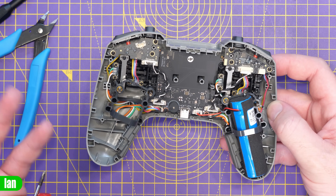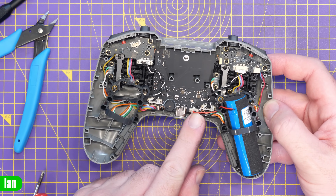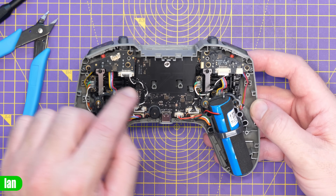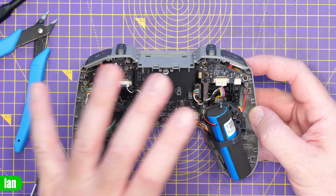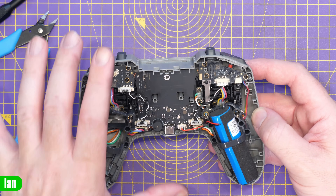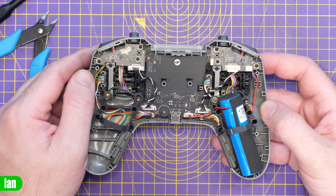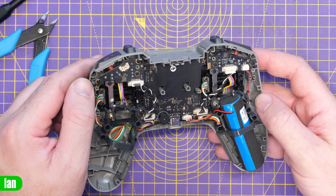So if you wanted to do a mod on this, there's potential for adding another battery in there, although there isn't a connector — you'd have to parallel them up. Just to note, what we've got here is our main PCB, and the first thing you'll see is our antennas, located on the PCB there. Whilst you've got that symbol on top for the antenna, that isn't the antenna. This remote only communicates with the goggles, so it doesn't need normal antennas — instead, they've got PCB antennas. There are two little antenna connections down there on the board. On this side, we've got a flash ROM chip.